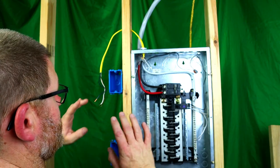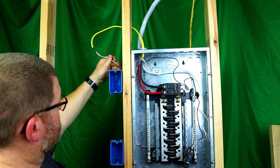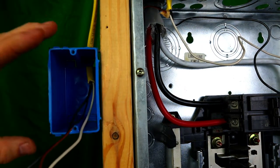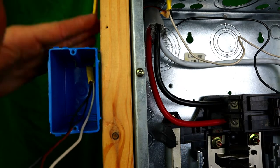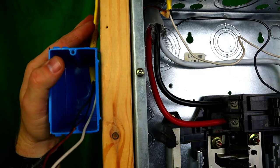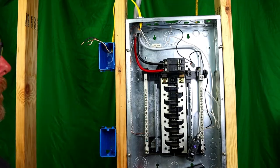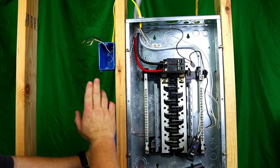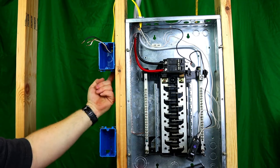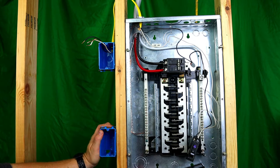First thing we're going to do — pretend that we have the wire pulled. We're going to take this breaker out because we don't need this breaker. We're going to put this wire into the box. This is a new circuit, so we'll put it here in the box. You would put a staple right here because that's code, but for this video we're not going to worry about staples. What we'll need next is another piece of wire from this box down to this box — all you need is a 12-2. We're going to pop the bottom of this box out and put the wire in.